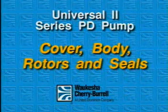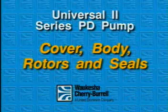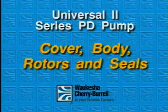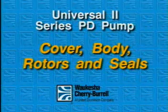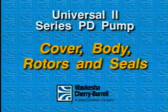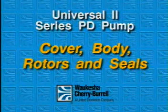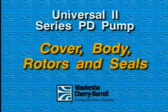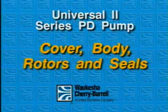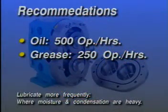Because Universal 2 series pumps are precision-made and have extremely close running tolerances, take care when cleaning and handling the fluid head, which includes the cover, body, rotors, and seals. Catching wear early is important to reducing your maintenance costs. Periodic checking of lubrication, noise, vibration, and bearing temperatures are recommended, as well as a simple look-feel inspection of your pump. Waukesha Cherry-Burrell recommends changing the oil at least every 500 operating hours.